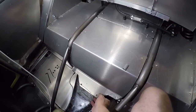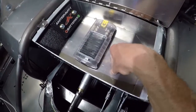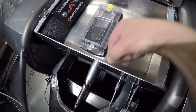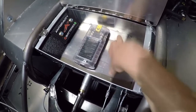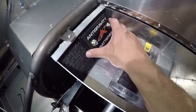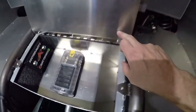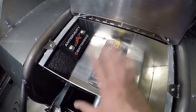This is my access panel — open it up, and underneath we've got the electrical box we just made. It's extremely sturdy because I made it out of pretty heavy gauge aluminum, probably around 0.095 — it's welded solid all the way around. That's important because I want it to protect these lithium batteries from rocks bouncing around underneath the bug. This will eventually have gasket tape up and around here so that when you close the lid it somewhat seals it — just enough to keep rocks, debris, and water from splashing in. It's not meant to be waterproof. Thanks for watching, guys. I hope this gives you some ideas and maybe motivates you to go work on something of your own. I'll see you in the next one.